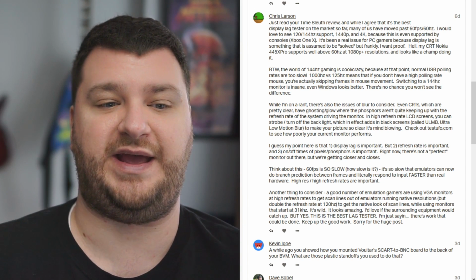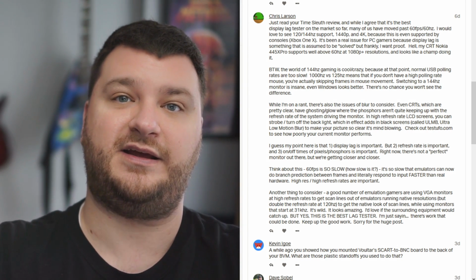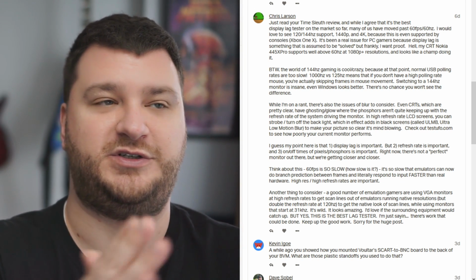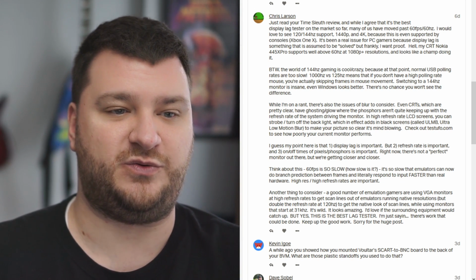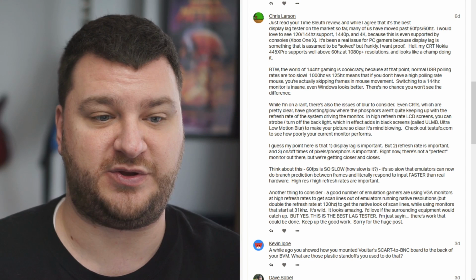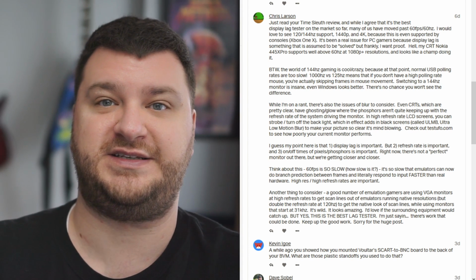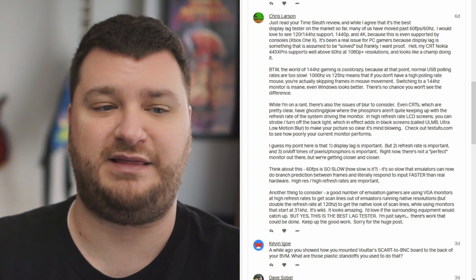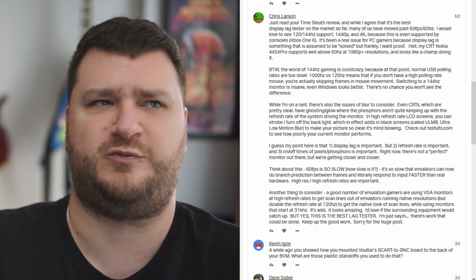But when I say display lag, I'm talking about if you have the same source going to a CRT and an LCD, how much lag is added on that LCD. And then, of course, there's the actual refresh rate on the screen, which is why sometimes if you have a character running fast across the screen on an LCD, you'll get that blur that you were talking about. I've heard that referred to as display lag. I've heard input latency. I've heard a lot of different things. I've always just called that the refresh rate. But yeah, maybe I'm wrong. Post down below if there already is perfectly good nomenclature for this and I'm using it wrong. Let me know and I'll change. But it is still confusing to me, even though it's something I work with all the time. And I think there would have to be a different way to test that final latency that you're talking about, the blurring on the screen, refreshing.